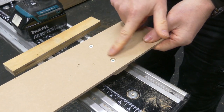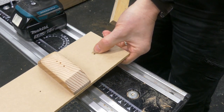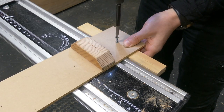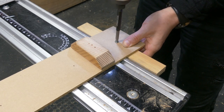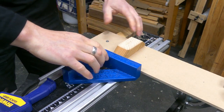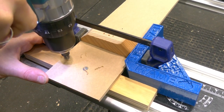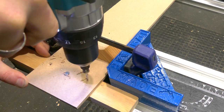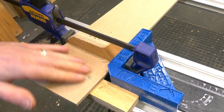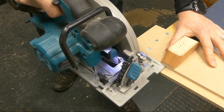I've screwed a scrap handle to a very long piece of 6mm MDF that has a factory edge on it that we know is straight. Drill a single hole through and screw in a cross member, making sure you've left more space than the clearance that your blade needs. Grab yourself a square or better yet a check square. Ensure that the 90-degree angle is there between your long cutting guide and your cross member, then screw the cross member in nice and tight. Grab a circular saw and trim off the end of that cross member to give you a perfect zero point.